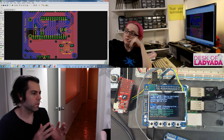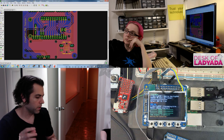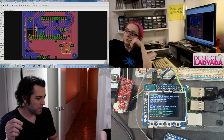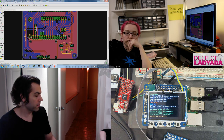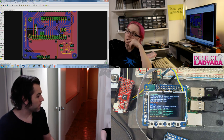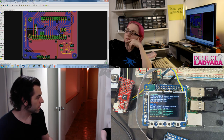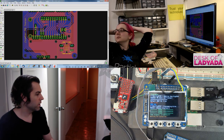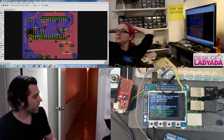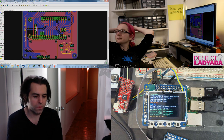I remember it was first design a kit, then design something that could be crudely manufactured in a very small pick and place and a toaster oven, and then design for manufacturing in a more optimized process. Then design for manufacturing on really good equipment like we have now, adding bits of machinery like a stenciler, a board loader, a conveyor, and a grate oven. And eventually it doesn't matter how good you are at manufacturing, you also have to be really good at testing. That's the next round of challenges for companies.